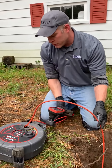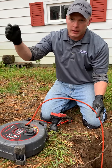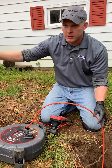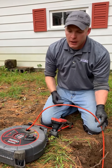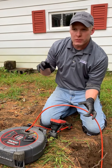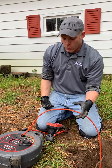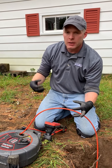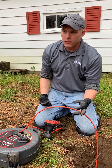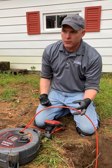That displacement is really typical to see. As long as the effluent can continue to flow through there, even though it's not 100% correct, it can still function — it's something to monitor and maybe repair down the road the next time you have access to it, but it's not necessarily a critical failure right out of the tank. Also from the camera I can tell we have PVC pipe and it's not perforated, so as soon as we see perforations that's considered part of the absorption area — that's where I need to measure from to my wellhead. First sign of perforation or holes in that pipe is absorption area, even if it goes on to a cesspit or a D-box.